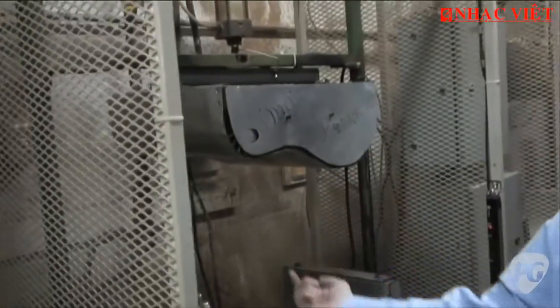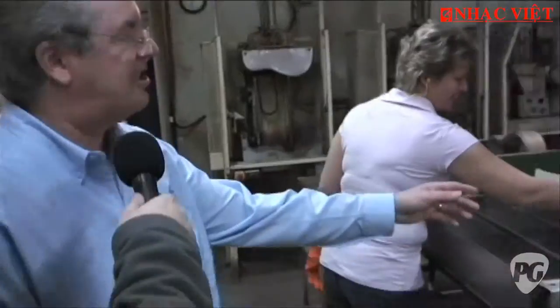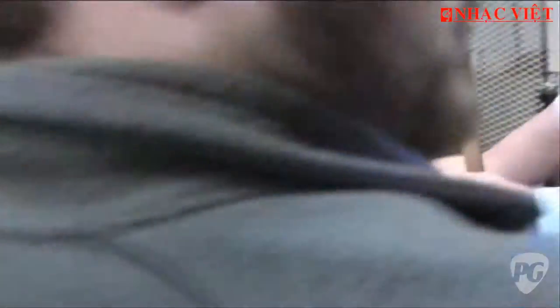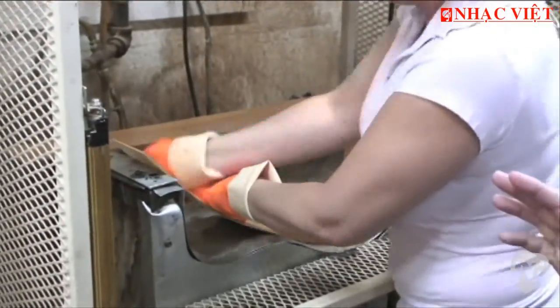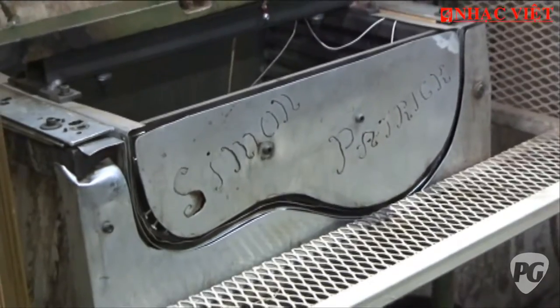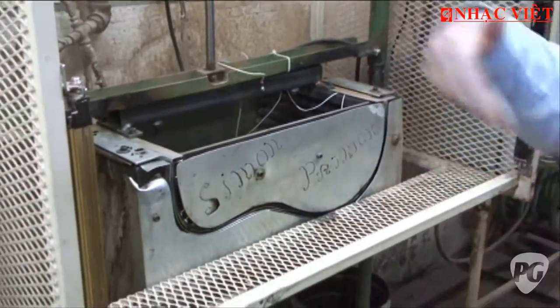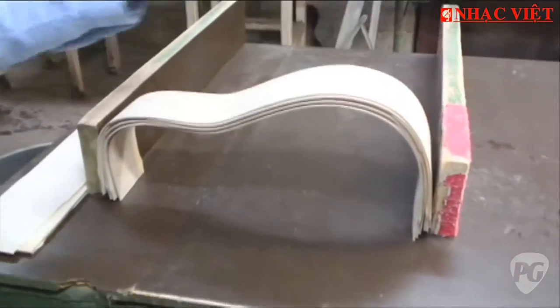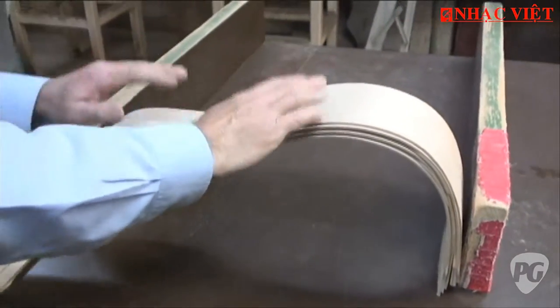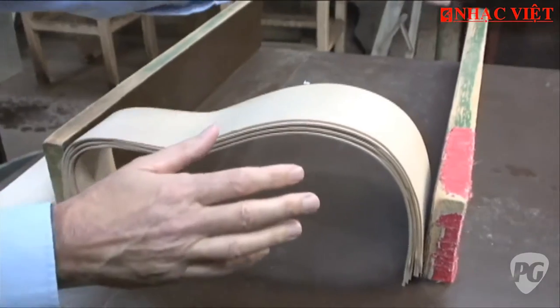All these molds are made by us. They're heated here at the bottom. She's going to put the side in boiling water for a few seconds, then press the side at just the right speed — if it goes too fast it breaks. The heat is going to set the curve in two minutes and the sides are made. After, she's going to put them between two pieces here so they cool properly, because if you put them on a table they're going to twist.